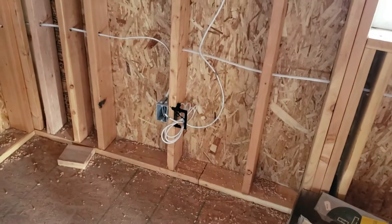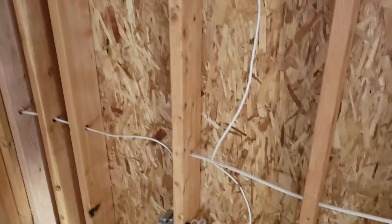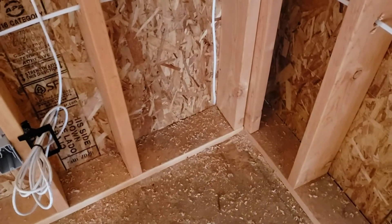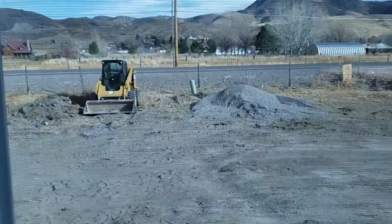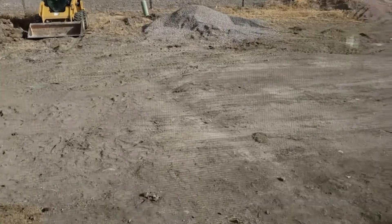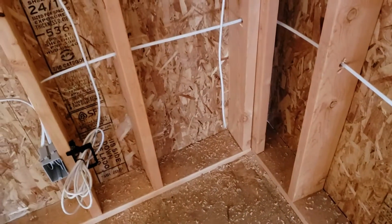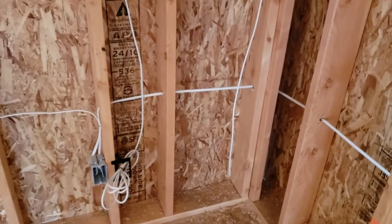Here I've got Cat6 going to the office — I need to do a little cable cleanup there, add some zip ties and get it away from that electrical. I also ran a coax cable to the outside with about 10 feet of excess for the incoming internet. In our town we have cable internet — you can see that little green post in the middle of the screen where the coax is buried by the road. They'll trench it, run a cable to this location, and put a box in the wall, which makes things a lot easier.